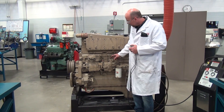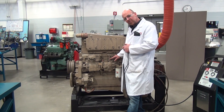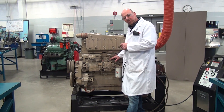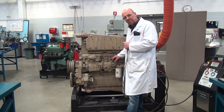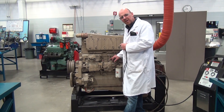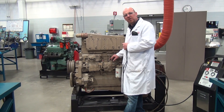You can see what I've done is wound the screw back out, cutting off the fuel supply to the engine and allowing the engine to stop. Now we're going to take a look at the operation of the valve train and the jake brake assembly compared to a typical 855 engine that does not have jakes. This one is a jake engine, so we'll take a look at the operation.